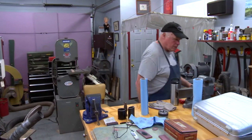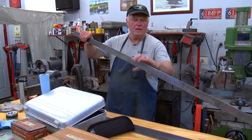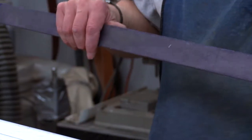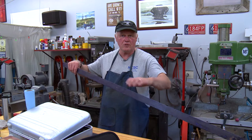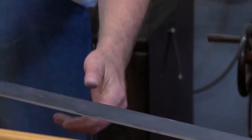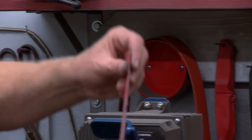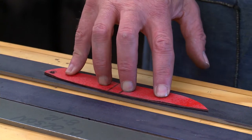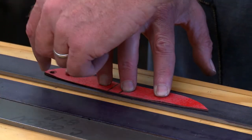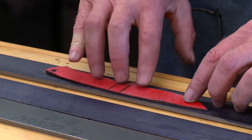This is what a six-foot bar of CPM-154 looks like. The first thing I do is paint it with Dykem, which is layout dye — it turns it blue, so when I scratch on it with a carbide scribe I can see what I'm doing. I take one of my patterns — I paint them red if I use them often — clamp it down on the dyed steel, and scribe around the top, blade, handle, and back end.